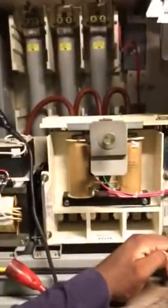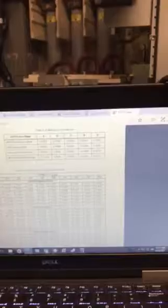The rating for these CTs is 150 amps. For me to actually be able to get up high enough to operate this relay, I'm going to need to reach 1.5 times the CT rating. So the rating is 150 amps, meaning I need this to get up to at least 225 amps before operation.